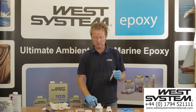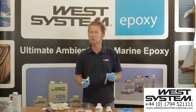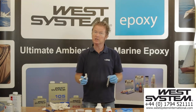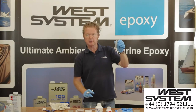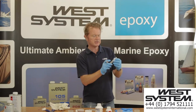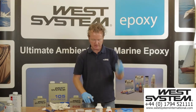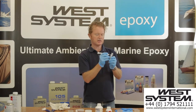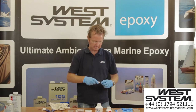It's very important to mix the West System resin and hardener at a 5-to-1 ratio. You can do that by weight or volume. Small weighing scales are fine, but for very small amounts, these syringes that are supplied in the mini pack are perfect. It's a very good idea to mark each one with an R for resin and an H for hardener, so they don't get cross-contaminated.